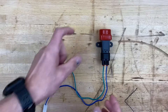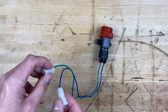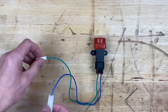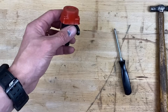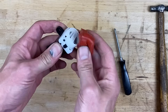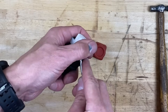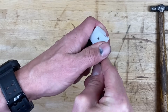With it wired this way, when the button is pushed down, these two wires are connected to each other. If you tap this with a hammer — or if there's a car accident — the button pops up and there's no longer a connection between the two terminals. Now we're ready to take this apart. Let's remove the rubber boot on the top — under it we have the button, and we should be able to pop this white button off and see the magic underneath.